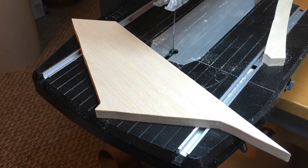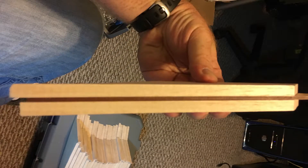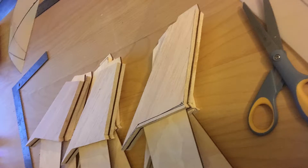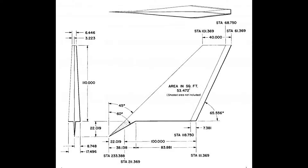I have since acquired a laser cutter but haven't had it set up yet — that'll be the subject of future videos. On top of the birch core, we put balsa — pretty thick balsa, about a quarter inch on either side — which brings it to the scale size for the actual fins. By putting balsa on each side, I was able to create the shape of the fins. If you look at the diagram for the Saturn 1B fin, you can see it decreases in width from the root to the tip, and if you look at it from the side, there's also a decrease in width from the trailing edge to the leading edge. It's a pretty complex fin shape, but by putting balsa on either side of the birch core, I could sand it to shape fairly easily and still have a fairly lightweight fin.